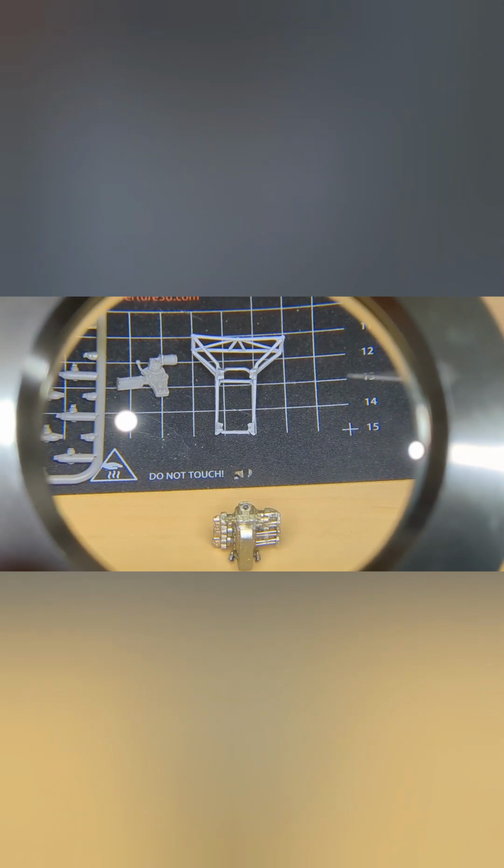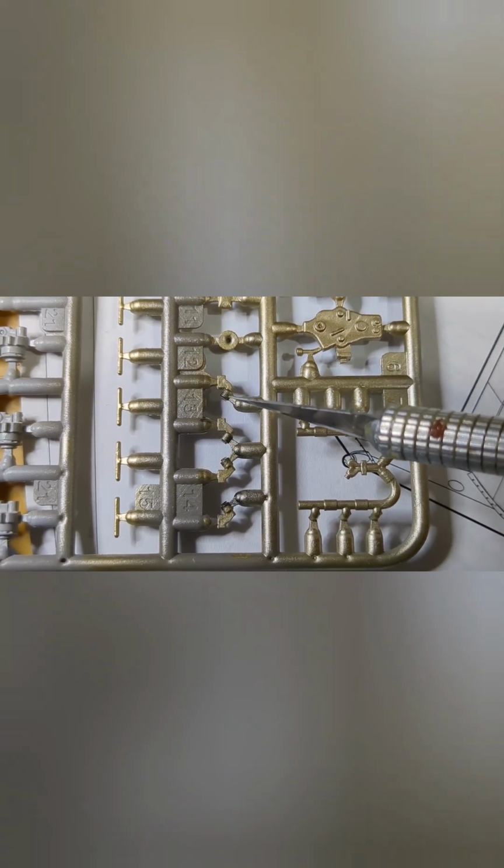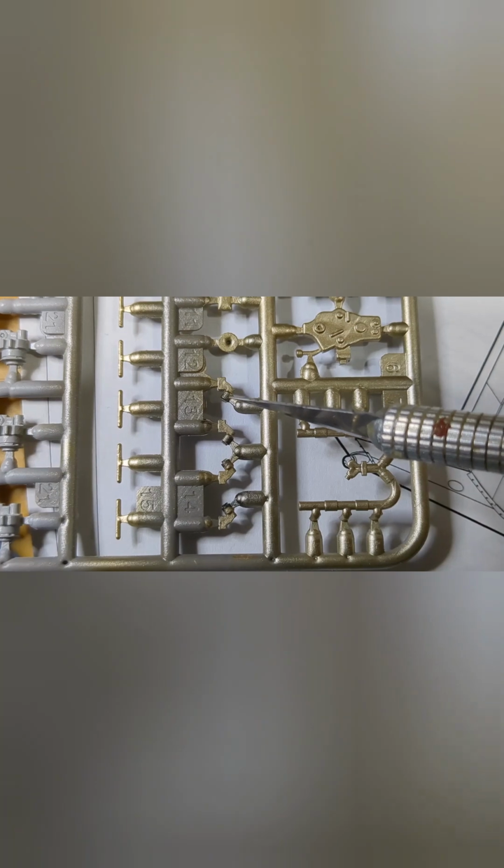For the last few days, I haven't done any updates. I was working on the engine, trying to get the engine all assembled. I stumbled across a problem when I was putting the engine mounts on the engine. Originally, the way the kit is, the engine mounts, as you can see, are shaped like that. This is where the mount attaches to the engine, and an arm comes out and puts the mount into a very awkward V shape, which is pointing towards the crankcase of the engine.